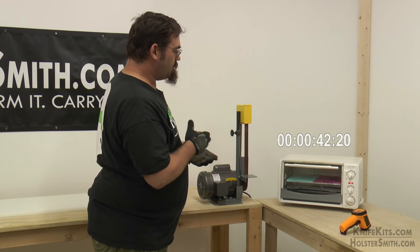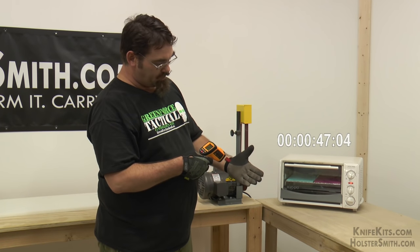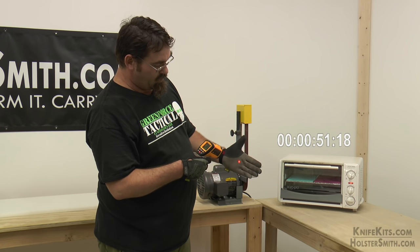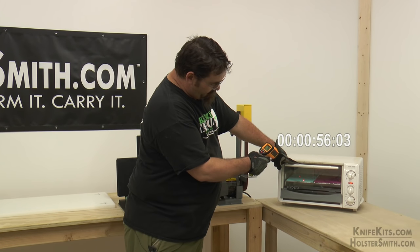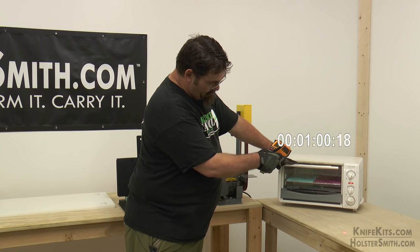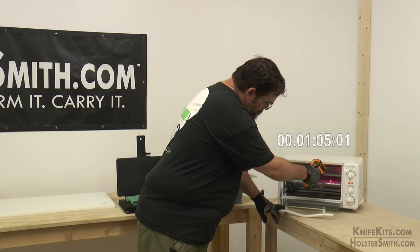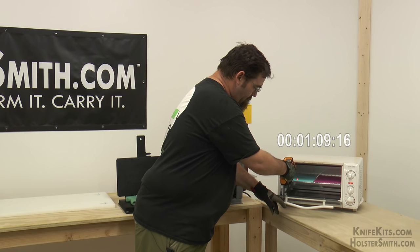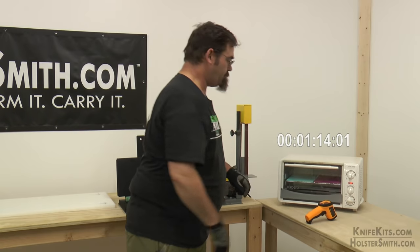It's not cool. So we need to talk a little bit about temperature sampling. When you're using a non-contact thermometer, and again, we're shooting for in excess of 300 degrees, the little red laser spot is where you're measuring. So you can't measure the glass from the outside, because all you'll do is measure the glass. It's 97 degrees. Now, if you go inside and measure the KYDEX, KYDEX is already up to 114 and 117 degrees. So when you're going to take your temperature, open it up, shoot it in a couple places to make sure you don't have a hot spot, and close the door.